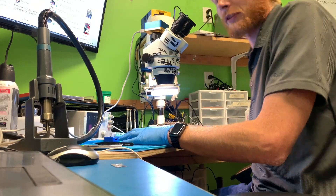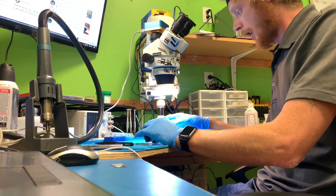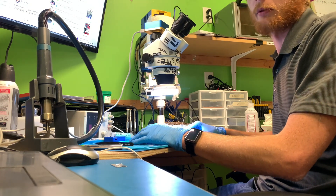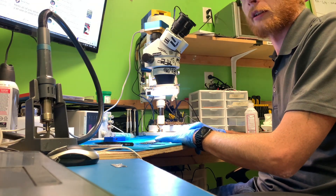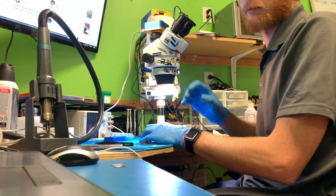I just got the board out of the housing, so what we're going to do now is a visual inspection on the board. The TriStar tester did pass the charging port, but that doesn't mean terribly much — it is pretty reliable, but I've seen that if I took TriStar off it would fail at the charging port dock. So we'll go ahead and take a quick look at the board.